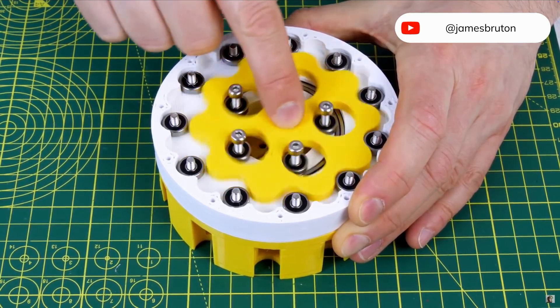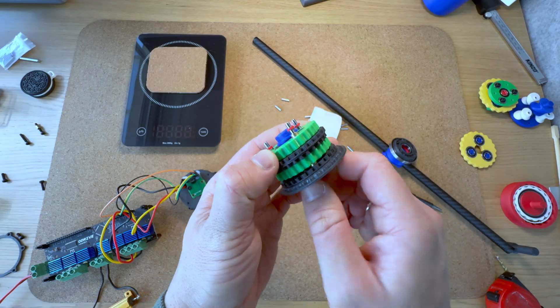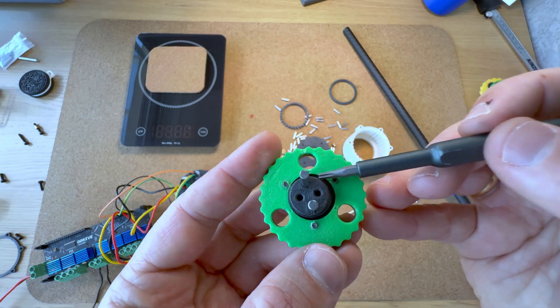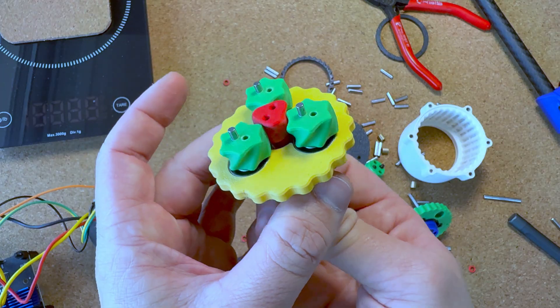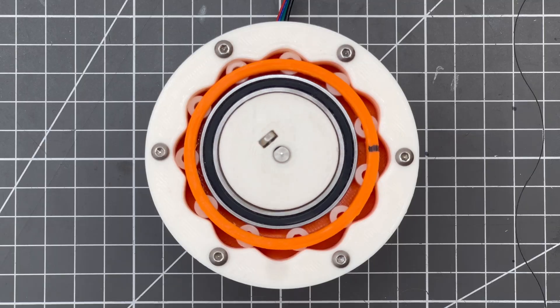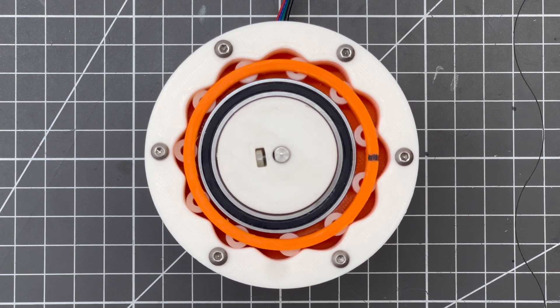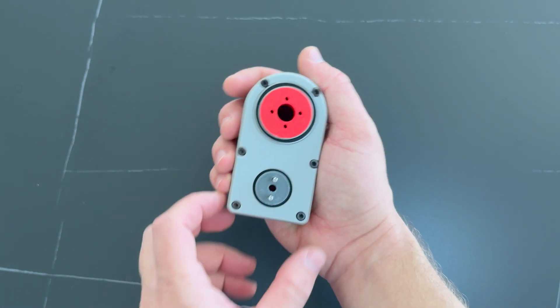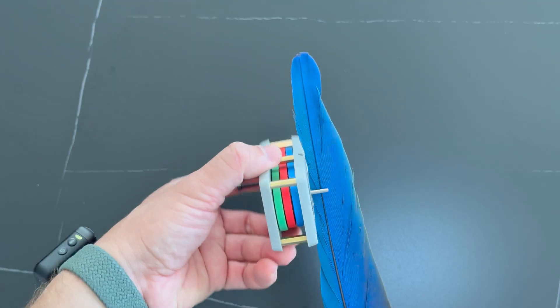But I'm not a big fan of the eccentric pin hole coupling used to transfer the torque. You have to match the bearings or bushings to the pin diameter to compensate for the eccentricity, and without bearings plastic holes can't handle high torque. So I'm always searching for ways to simplify this design for 3D printing. One of them is wavedrive with rolling elements, which I already made a video about. But this one is different and honestly this is the simplest cycloidal gearbox I've ever built.